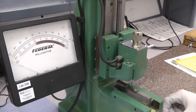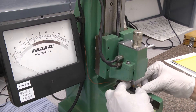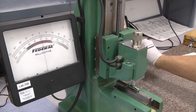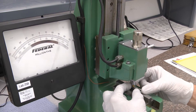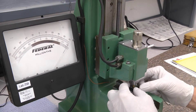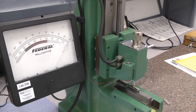We put the .1 inch gauge block into the comparator and set it for a zero offset. We then remove that gauge block and put in the larger gauge block, which is 50 millionths offset. We can see that we are indicating within one micro inch full scale.